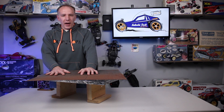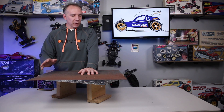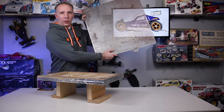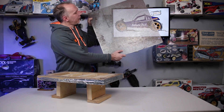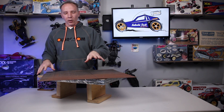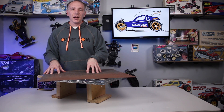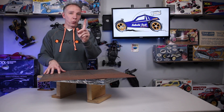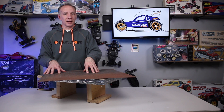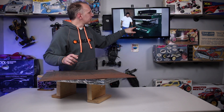The design that most of you have is really a design of what's called a skin packaging machine. I'm going to show you what I'm betting you have — something similar to this: a sheet with a whole bunch of holes in it. You have a steel sheet, a cookie sheet, or a wooden board with a lot of holes in it. That's okay if you're skin packaging, but it's not really the best design if you're doing serious vacuum forming of more than just one or two of a part.